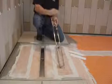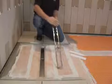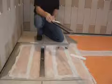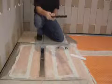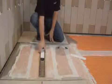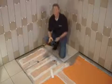They are threaded so they can adjust up and down to correspond with the height of your tile. You'll also have some spacers for the frame that keep that frame at a consistent width during the tile installation. That's the part we're going to do next, so let's do it.